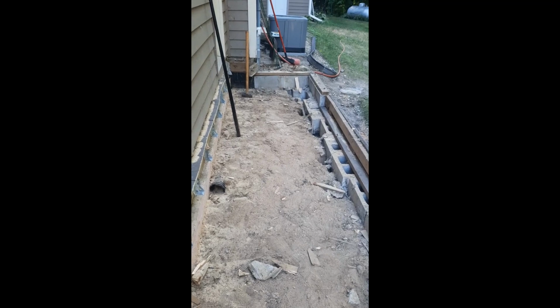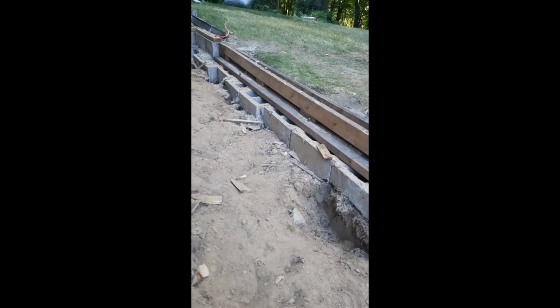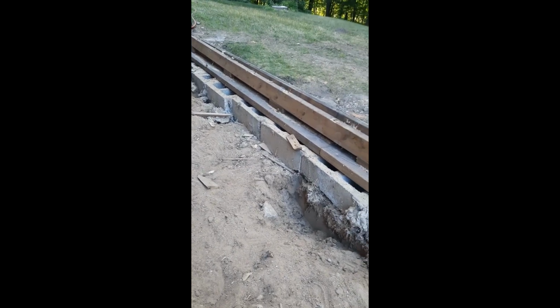This is the old foundation that they had. I think it was just a bunch of hodgepodge block that they had left. I mean, it's like 12-inch, 6-inch, 8-inch. There's some 4-inch over here. I don't know how deep they go. It looks like there's some spots that are 3 courses deep, and there's other spots that might only be 2 courses. Over there, it's really hard to tell on video, but it's really crooked and heaved up. This porch was very patched together. They got a bunch of boards along the front that are all shimmed up and kind of just pieced together.